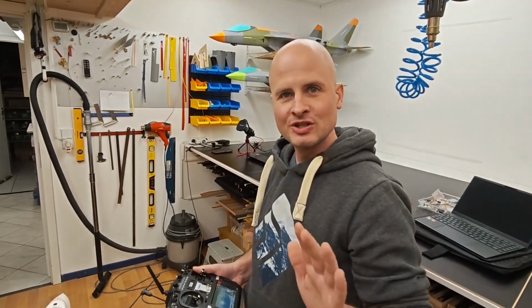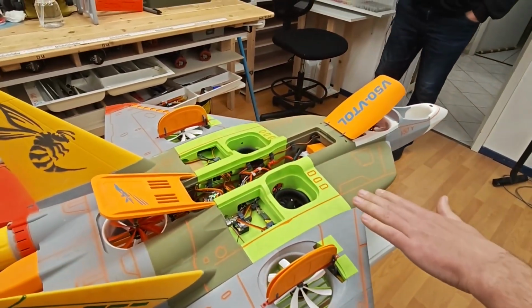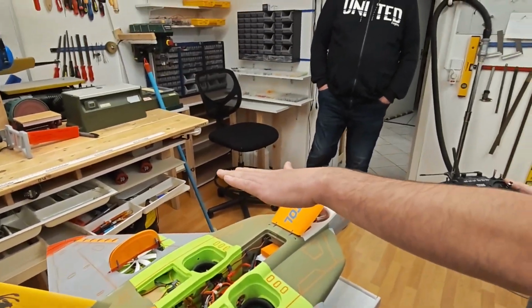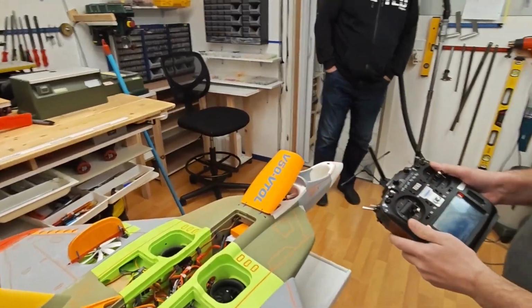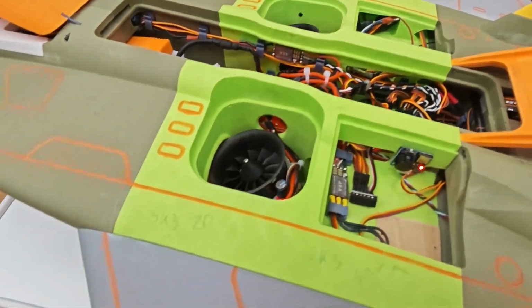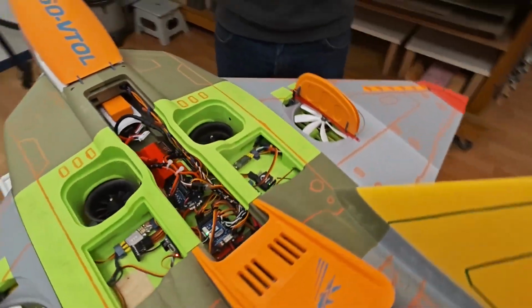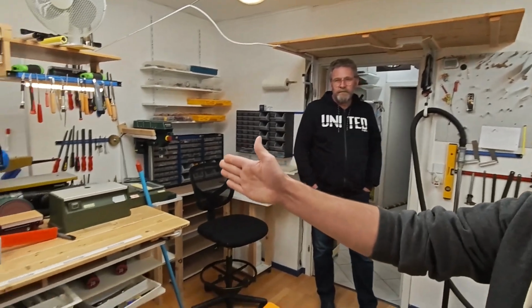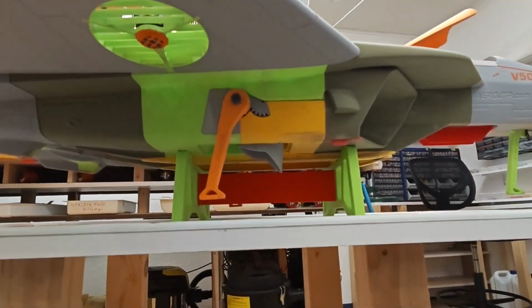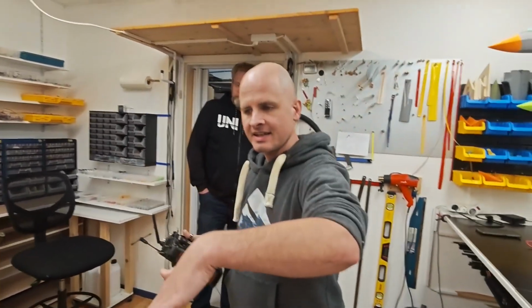So now we want to show you something special. Maybe you saw in the last videos when we have a lot of headwind and we don't want to pitch the whole airplane too much. So we installed a special mix. And this mix, when you pitch forward, you see that the main EDF gets tilted. So we got not just a vertical vector from the main EDF, we also got a forward vector. And this helps us to hold position against strong headwinds without tilting the whole airplane.